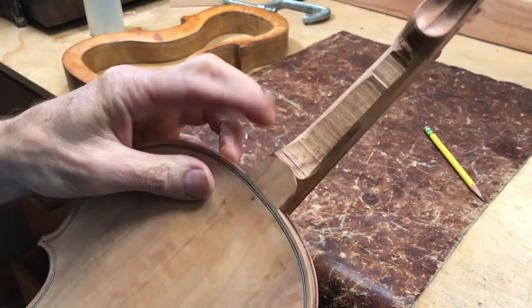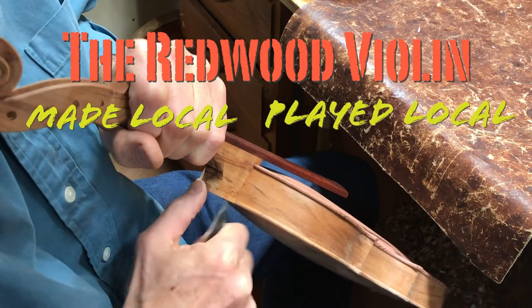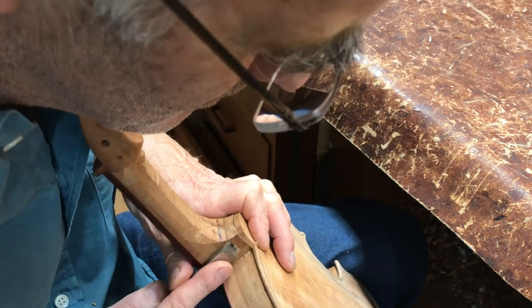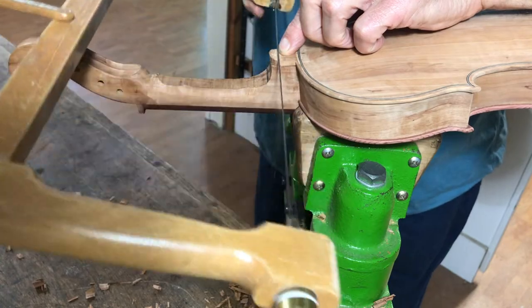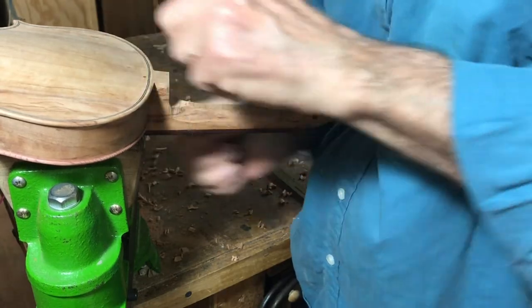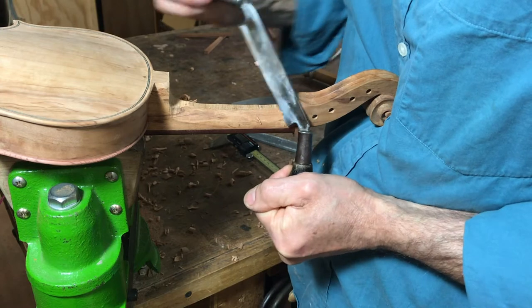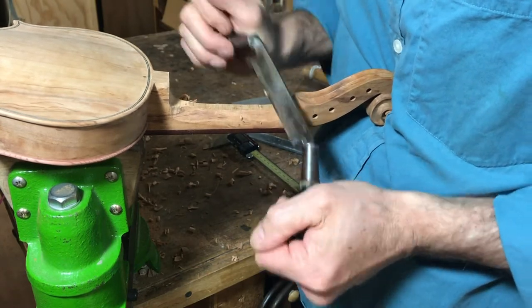Off the button on either side and make these lines run straight through. This is a draw knife — it has the flexibility of a knife but you get extra leverage on it. If you anchor one end, you actually have some levering action going on there, so you can make quite controlled cuts with it and it tracks as well as a spokeshave.